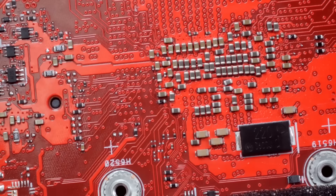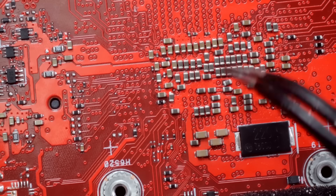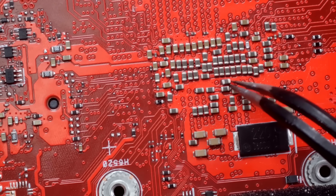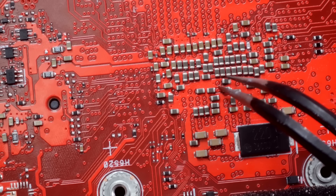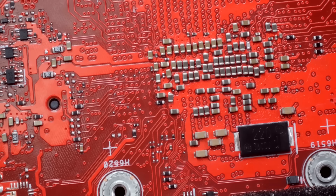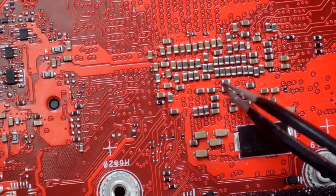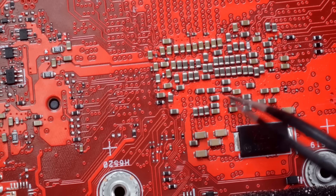One of the things I noticed is there's this random capacitor that's like off-center. That's like broken off. That could definitely be a problem — or it might not be — but that could definitely be an issue. The problem is that the pad underneath there is probably torn. That being said, we need to explore that.